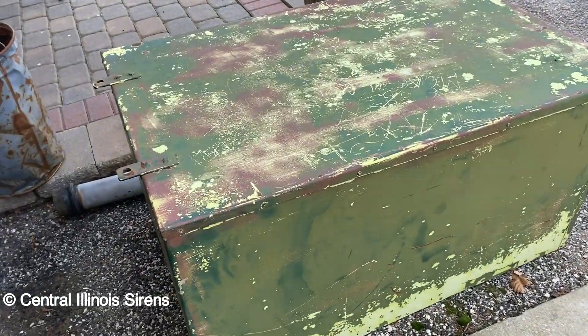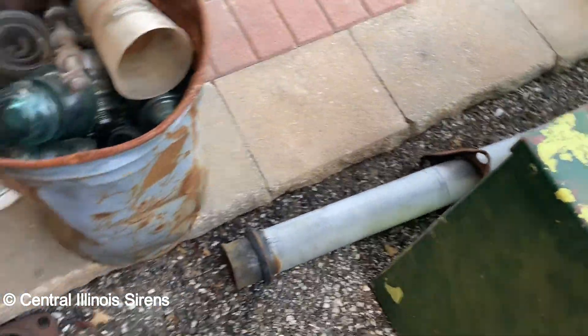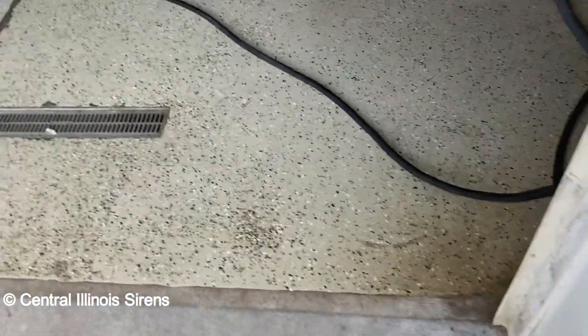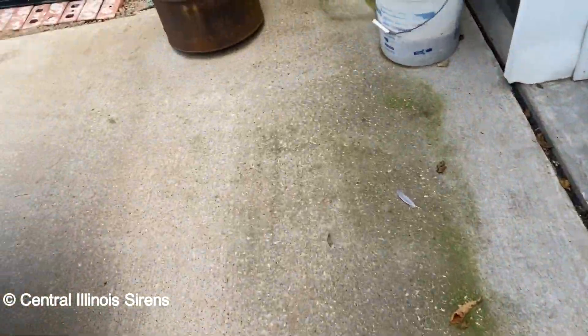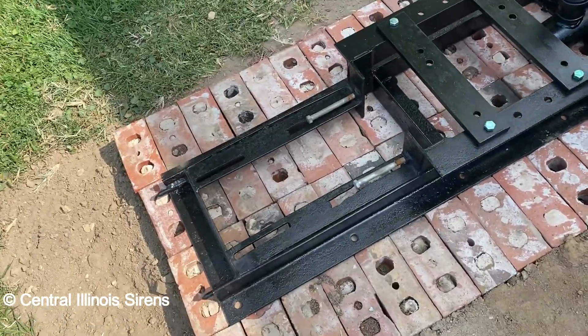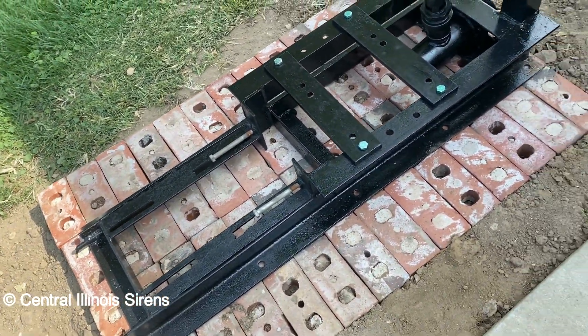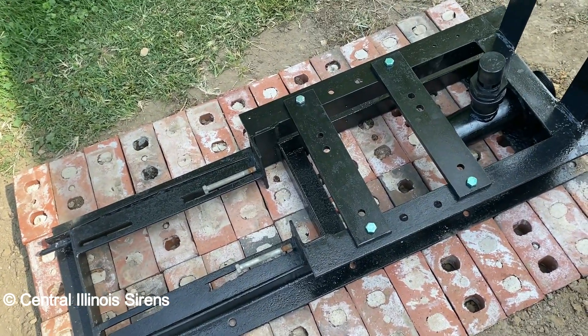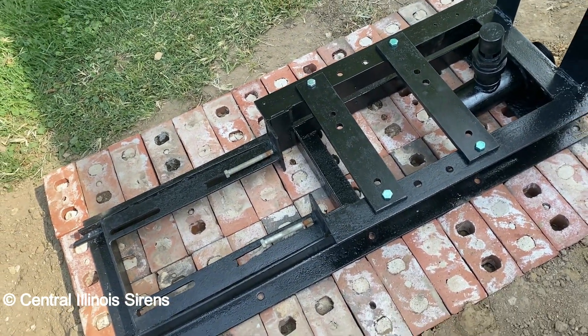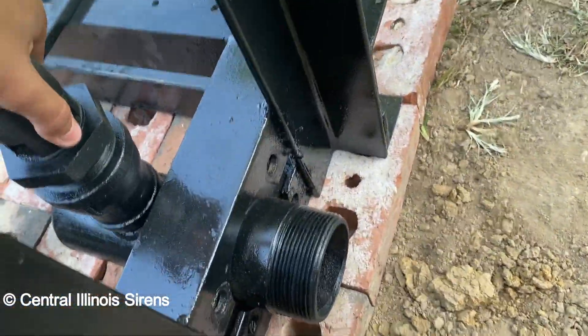Here's the cover — there's nothing under there. This is part of the old standpipe with a coupler on it. There's a blower motor — it's three-phase, it's not the original, but the bearings are great on it. Here we have the blower pad and frame. It was a 6M but they converted it to a 4M. I wouldn't be surprised if it seized up and they replaced both things.